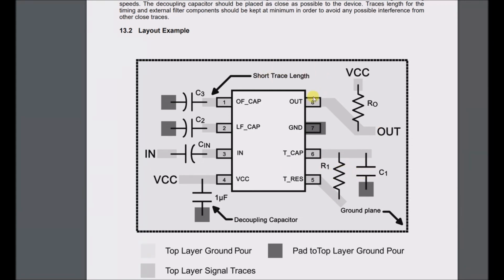This pin is a little bit interesting because you end up sending a VCC supply over to pin 8, and there's like a resistive load that you attach between. And I've seen some sample circuits that other folks have built, and this tends to be like an LED check light and a resistor. In the one instance, which I won't go into, they were using a 1K resistor.